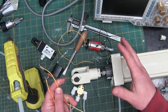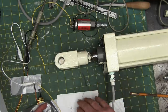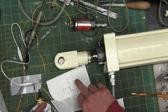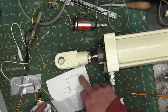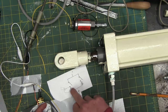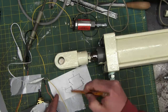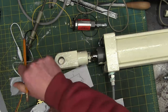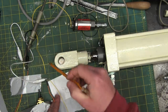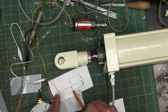And don't worry if you're not picking this up as I'm putting it down, because we're going to go over it. Getting this together, and I noticed I needed a jumper. So what we got going on is we got the plus going in, and the switches are paralleled. And then we got the two resistors, and they're not paralleled. So what we needed to do is add a jumper right here. That's this guy. And then we put the oscilloscope leads on one side of the resistor, and the ground of the oscilloscope lead on the other side of the resistor.